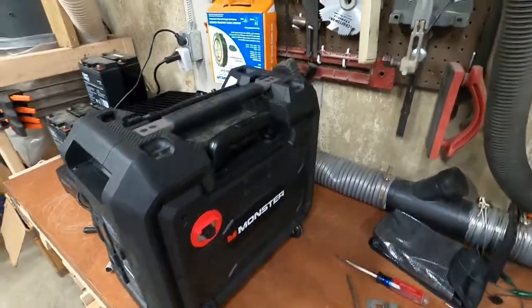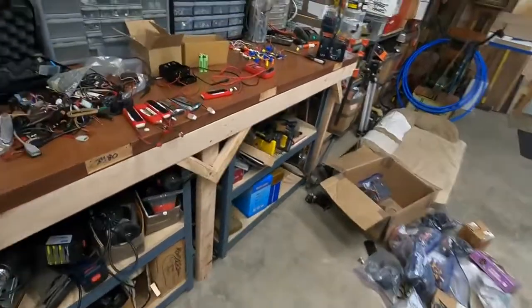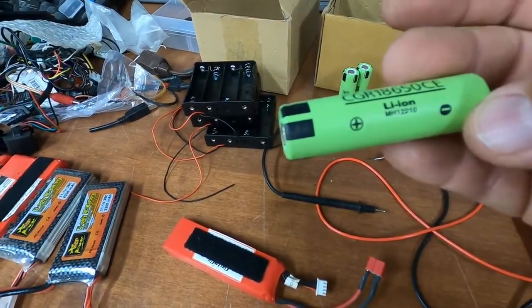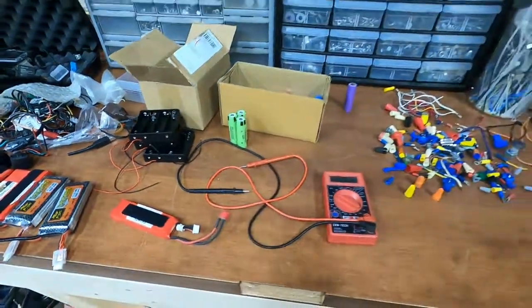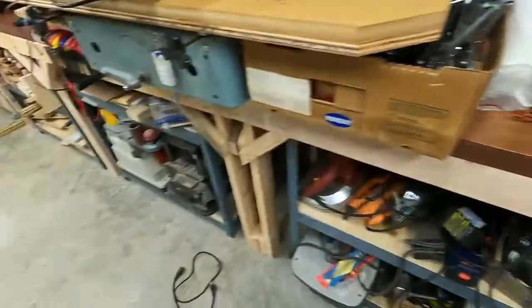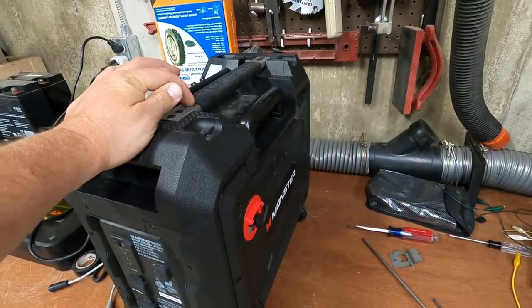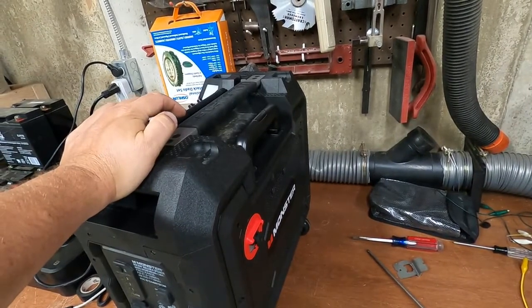So there's the finished product. New LiPo battery. Now, other facts of the case. These fellas over here, I thought I vetted those ones that were in there, and meh. If they are the Japanese good ones, Sanyo, etc., not knockoffs, if they're the real 18650s, and they came out of laptops or power tools, they should have a capacity of about, so sayeth Google, 1800 milliamp hours to about 2500. So let's say on the low end, 1500 milliamp hour per battery.